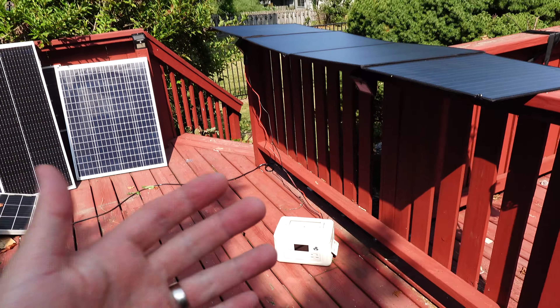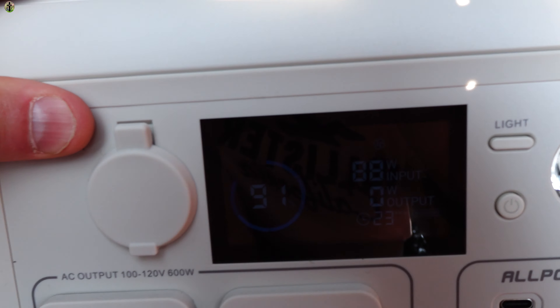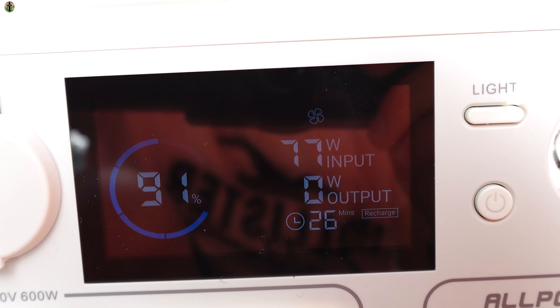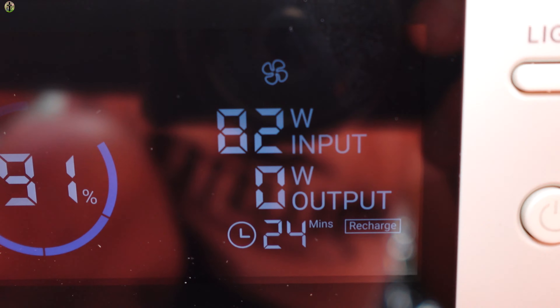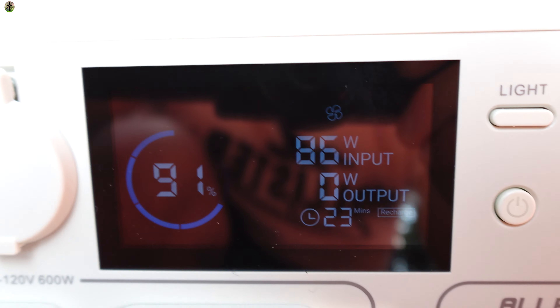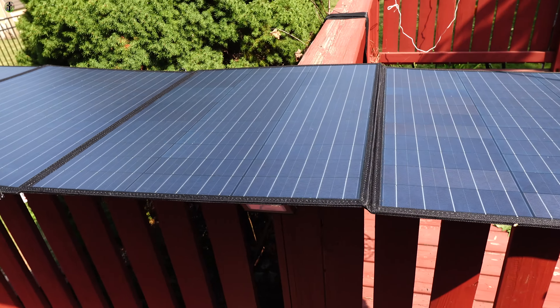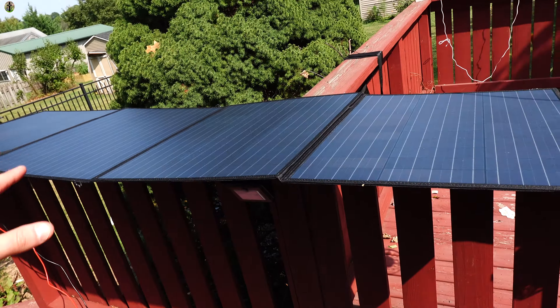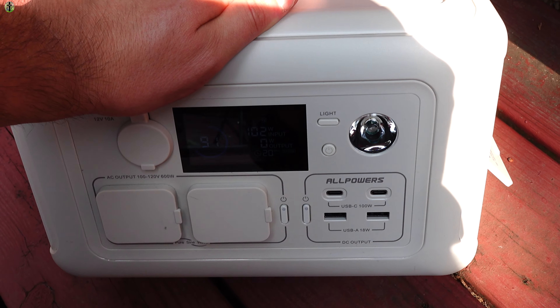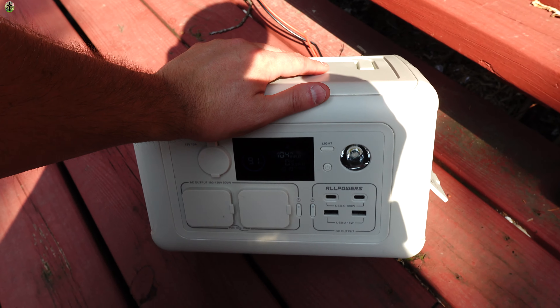What's awesome is it works great with All Powers power banks — the All Powers solar panel paired with the All Powers power bank. If we look down here, we're pulling in about 77 to 79 watts, which is a decent amount, and it's not even in full sun. It depends on how the sun and the panels are angled — it's best to angle the panels rather than lay them flat to maximize output. We're pulling in almost 100 watts with it flat, and we actually hit 104 watts, which is excellent.